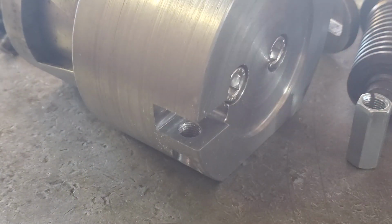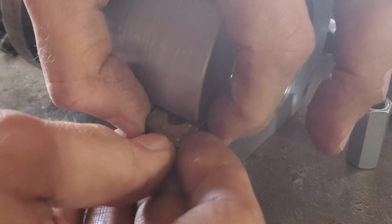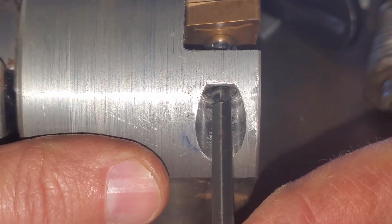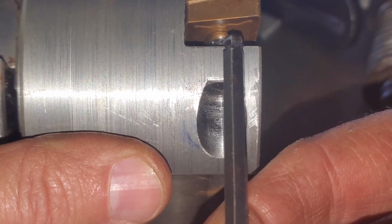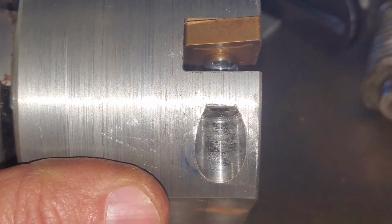To put the insert in, I have to load a ball bearing into that hole, and there should just be enough clearance to slide this insert past. Now, the action of tightening this set screw should jam that insert down into the corner and set the correct projection. So I don't know if you can tell from this angle, but the axis of the set screw is lower than the axis of the ball and the hole in the insert. So that means the cone hits on this side and it bears in that direction to jam this down against that surface and of course against the back.